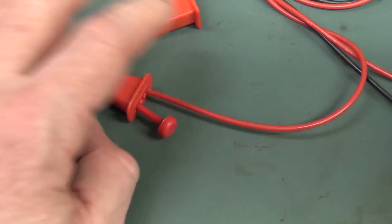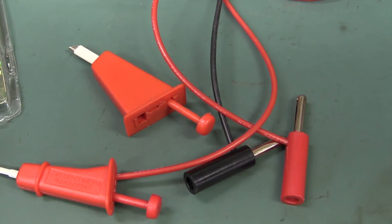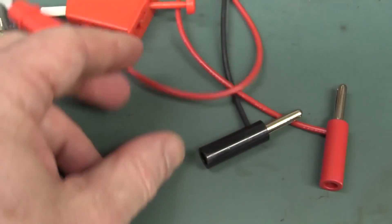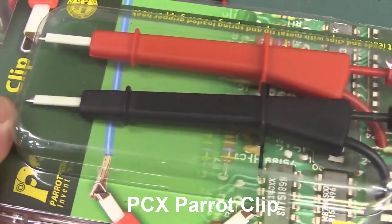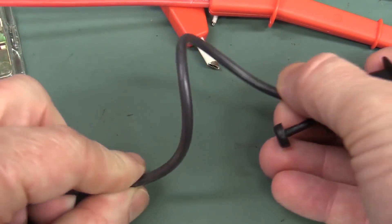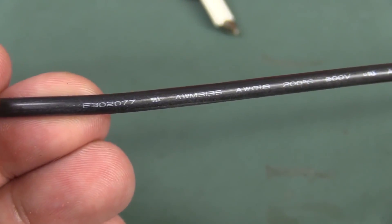The problem with easy hooks is they don't come with nice attachments that you can plug into your multimeter, whereas these come with all sorts — we've got the piggyback-style banana plugs, the shrouded ones, and binding post clips. These are just bigger, more robust. And check out the finger guards on these — if you're probing decent voltage stuff, you don't want to be messing around with an alligator clip; these are much safer. They come with really nice silicone leads as well — beautifully flexible, just like proper multimeter leads. They're suitably rated: Underwriters Laboratory, 10 amp, Cat 3, 600 volts.